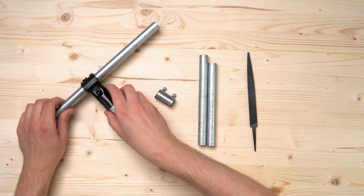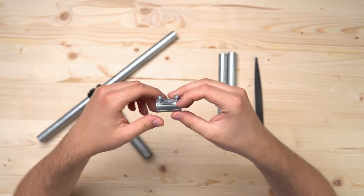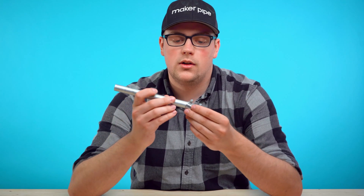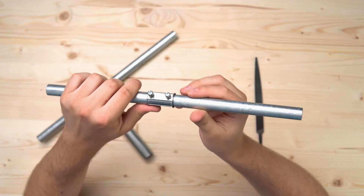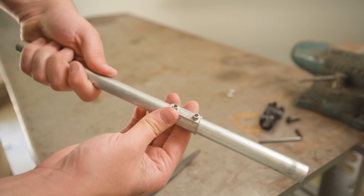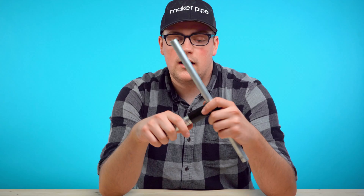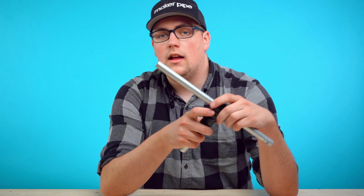This next design is really cool and useful because it gives you two options for movement — not only does it swivel around the pipe, but you can also slide it up and down. Dillon came up with this when he was building his adjustable solar panel stand. You get half-inch EMT couplers from your local hardware store; they have a wall in the middle that lets you put two pieces of half-inch EMT end to end, with two set screws to secure them. Dillon used a metal file to file down that wall so the coupler slides all the way over the conduit, giving you up-and-down motion. Then, removing the set screws, you can attach a T connector around the coupler — and even tightened all the way down, you still get a secure connection while still being able to slide up and down the half-inch EMT.